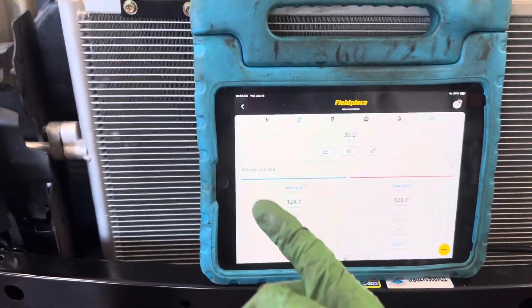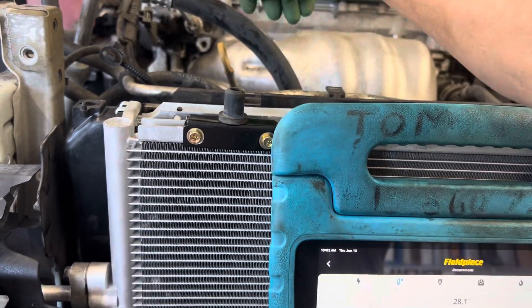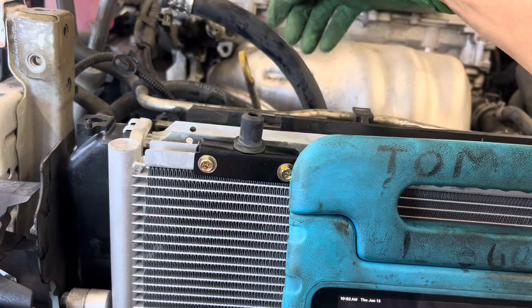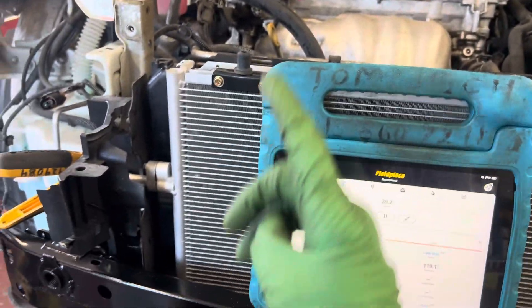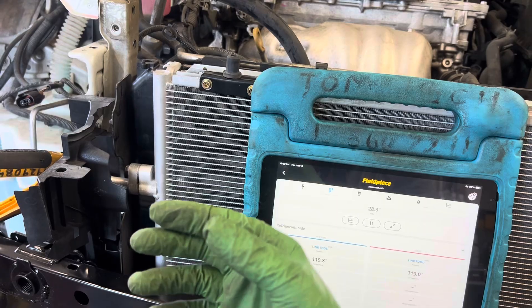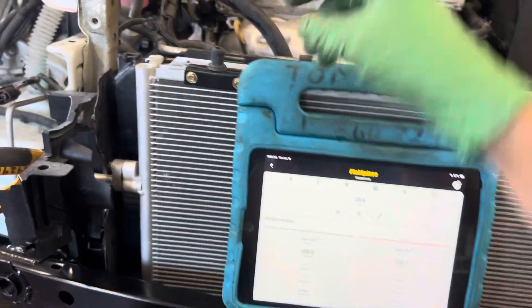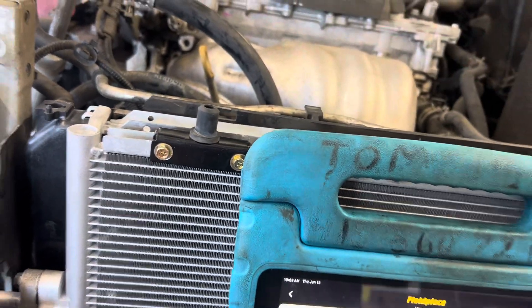You've seen that go down, and that's how you can test — but use something that is very rounded, don't use pliers like I just did. Use hose clamps, and you can test yourself and see what the pressure drop does. That's how you find linings inside the hoses that delaminate and become like a heart valve, actually stopping or restricting flow. They could be intermittent — not closing off, then five minutes later closing off. You shut it off, start up again, it works normally for five or ten minutes, then the inner lining moves and restricts flow and you get warm air out of your dash again.